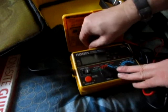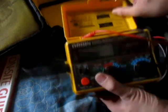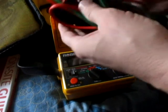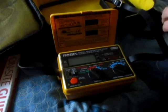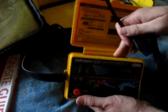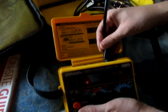What's next — loop impedance. I'll probably have to use the other set of leads to do it at the box. I'll connect this one to earth, live, and neutral for the socket. I haven't done this for a long time, as you can see — I forget most things.